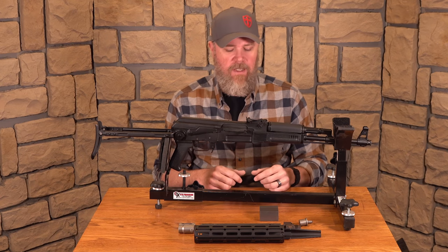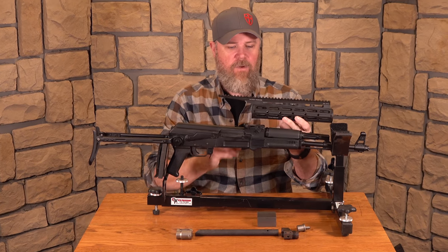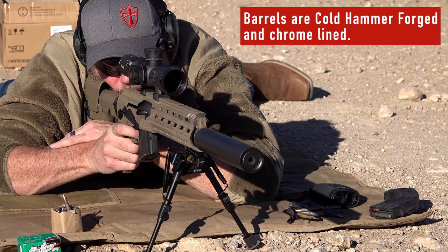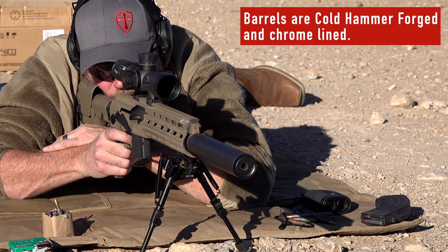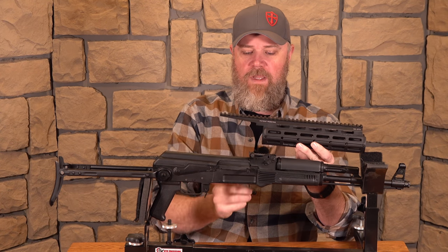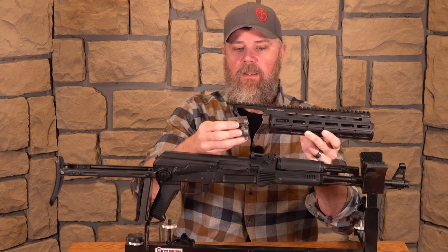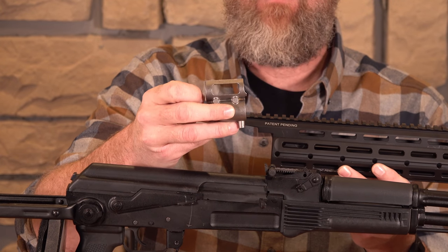So let's talk about the real meat and potatoes of what the AK-20 is. Laying here in front of me is the backbone of the whole system — an aircraft-grade aluminum handguard that truly free-floats the AK barrel. Other similar systems that have hit the market bolt onto or clamp onto the barrel itself; this does not. It's more like an AR-15 in that regard. On the receiver side, there will be an extension inside the trunnion that fits inside the handguard. On top is where the gas tube is going to ride.